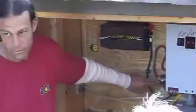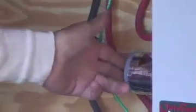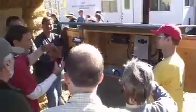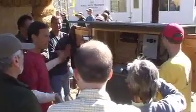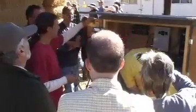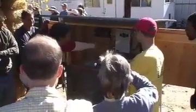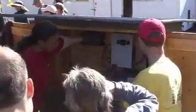This is also a handy spot to install a lightning arrestor or surge arrestor. This little silicon oxide can of sand is basically a surge arrestor — it'll fuse, it'll expand, it may blow up. That's why we try to keep it outside the enclosure so it doesn't make a mess inside. If there was a lightning hit, hopefully it would be absorbed either through our ground rod or the lightning arrestor and not reach our sensitive electronic equipment like the charge controller or the inverter.